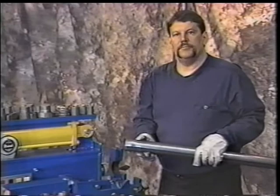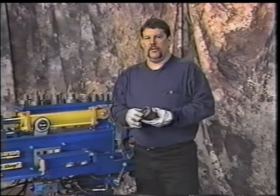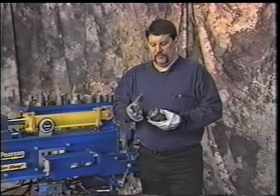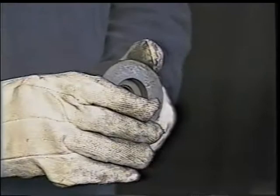We have other tools here. We have what we call a super chevy, which makes the insert and the 45 for the gasket just to slide on. So it has an insert inside the gasket and has a 45 degree flare for that 45 degree gasket to butt up against. If you flip that tool around, you've got the Super Toyota flare. And that puts a flat flare with a little stub out to put your flat gasket on, okay?